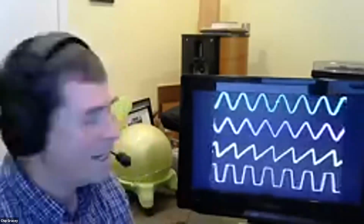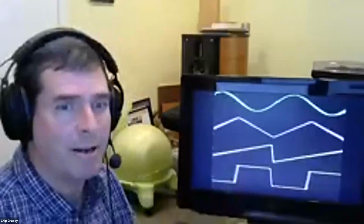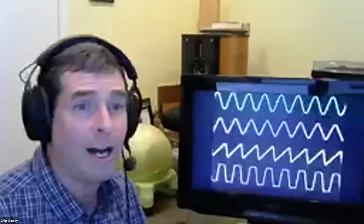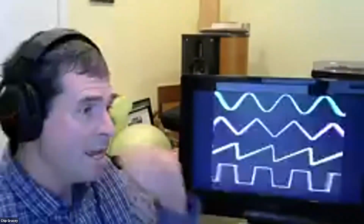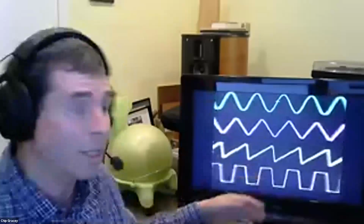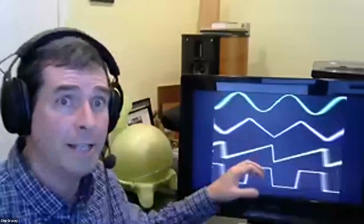And now in the future, I want to redo this thing. I want to make the A to D in the chip a lot better so that it actually generates about 4 bits per clock, so that in 16 clocks, we can get a solid 8-bit sample, and have a mode where we don't have an analog front end, because this is good for audio. It's kind of luxurious, but it only has a bandwidth of a couple megahertz, and then it poops out. It starts rolling off.